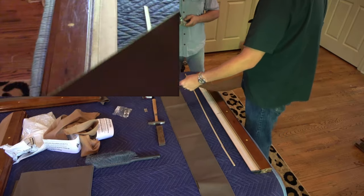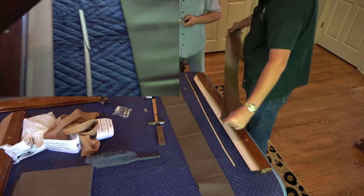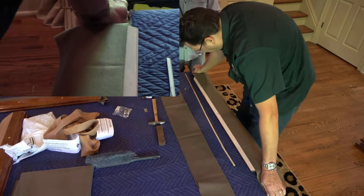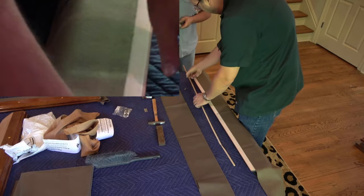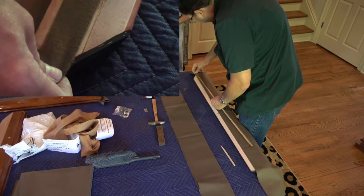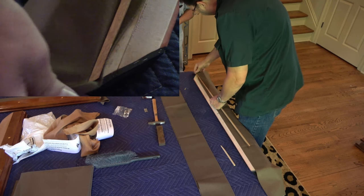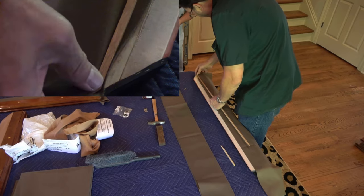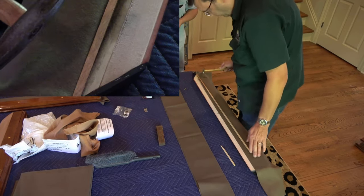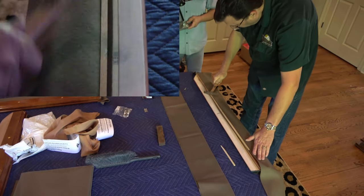So we'll grab our cloth, look for our face sticker. We're gonna flip it upside down, put about equal amounts on either end of the rail, and then we're going to grab our feather strip, put it right in the end, push it down with our finger at first, leaving about a quarter of an inch of excess, and then we're going to start tapping in the feather strip.